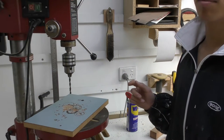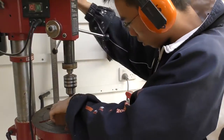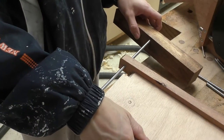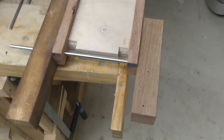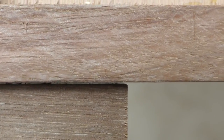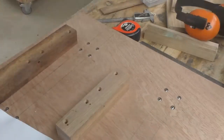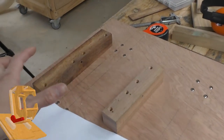I know from experience that sometimes this piece of MDF affects how perpendicular the holes are, so I'm taking it off. I'll be rotating the workpiece while drilling through, to counter any inaccuracy in the drill press. Not bad for my first try — this one is absolutely flush with the rail with no visible gaps whatsoever, and the other has just a little bit of gap at the end, about the thickness of one piece of paper, which I can easily close with just a bit of finger pressure. Now I can screw down these two blocks of wood to secure the pantograph, but I still need to make the two spring cams to get the correct spacing between the two blocks.